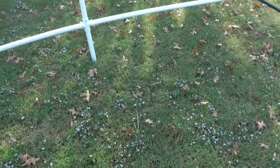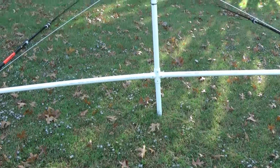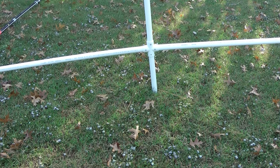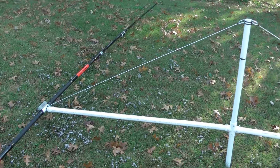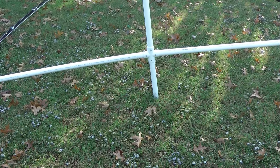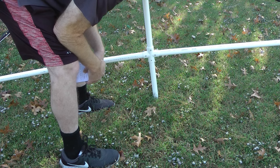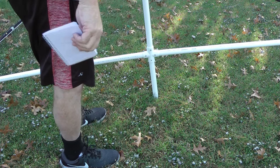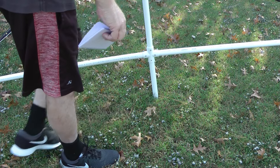Let me also get a picture of the boom. The boom is 108 inches long, and if you try and shorten the boom any more than that, you're not going to get a good front-to-back ratio. I added support cords running to the end so that the boom would not sag. The center is simply a 1-inch cross that I got at Lowe's, and to hook the beam into your rotor there's just a 1-inch piece of PVC pipe, with another piece running up to connect the support cords.